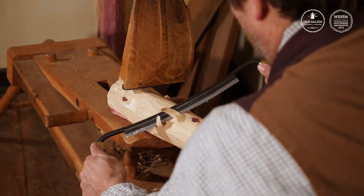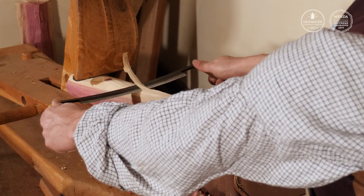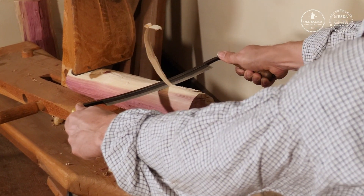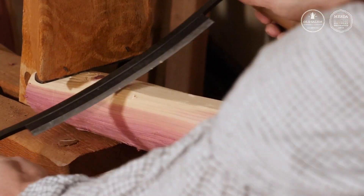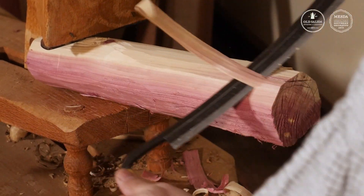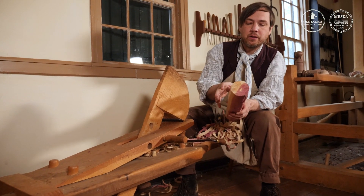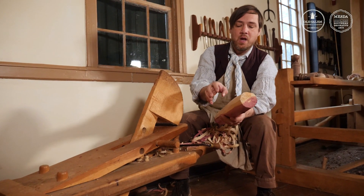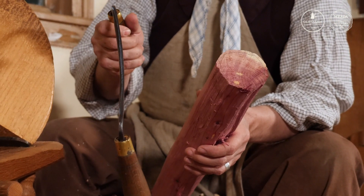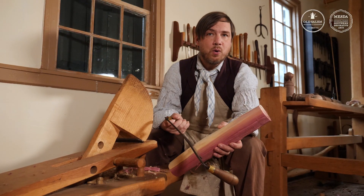You can think of the draw knife as an inclined plane as well. When it severs the wood, the wedge shape or inclined plane is lifting that piece of wood away from the bigger block. That's pretty close — not a perfect cylinder, but plenty good enough to move on. You can see how with each step the cutting edge of the machines I'm using is more and more refined, making a more and more refined shape.